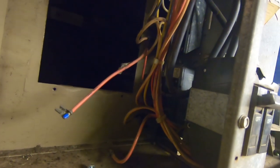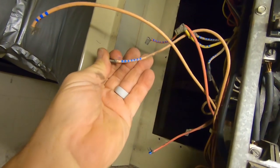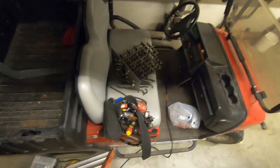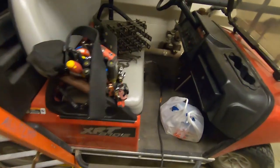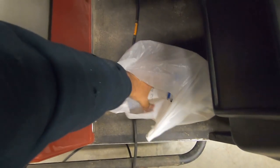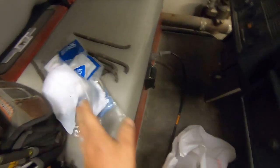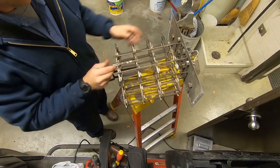We're going to put in new elements and new electric sequencers. It'd been nice to have some part numbers but I don't have any, so the generic thing I did was put dots on there and mark those with numbers at the location of where they go. You can actually use universal stuff — good old Mars and Honeywell — you can just rebuild it and get it back up and going. It wasn't the cheapest option in the world but it will work, and basically we just do what they ask.